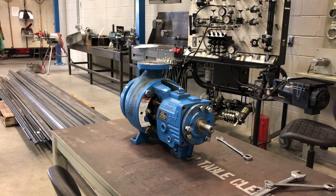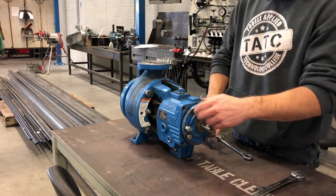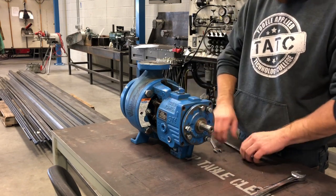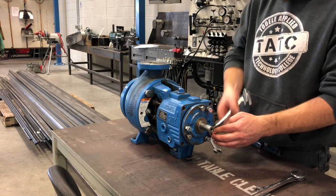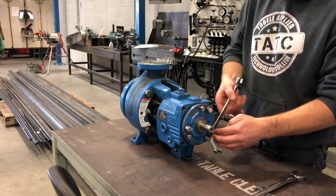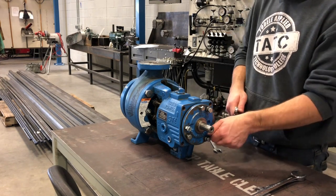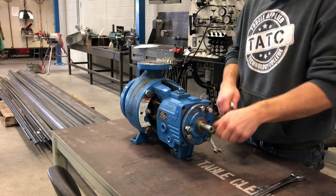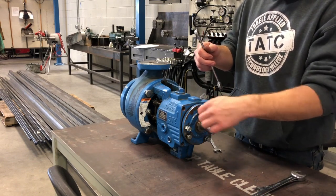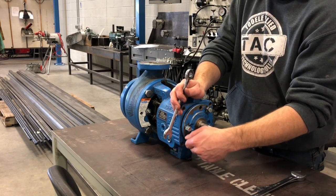Before we get too far, I wanted to remind you to make sure you drain all the oil out of it. The unit was empty when I started making this video so I didn't have to drain mine, but it'd be very smart to drain it out before you remove any of the shafts or any other parts. What will end up happening is you'll have oil all over the table and it'll be a much bigger job to clean up. So take the time now, drain all the oil out — maybe even while it's hanging from the crane — and then go ahead and continue.